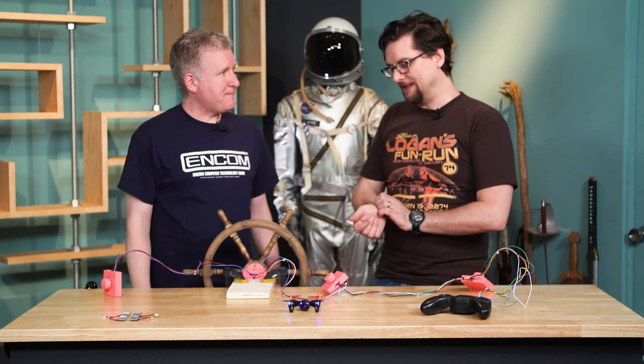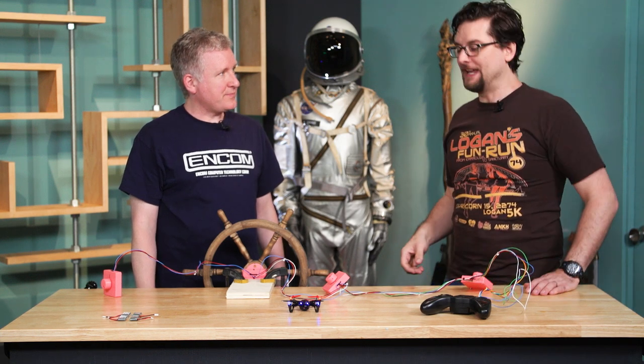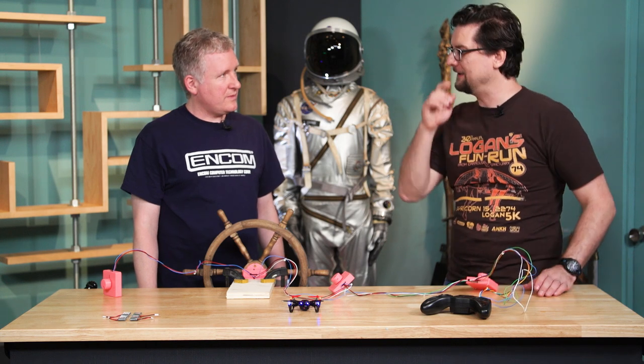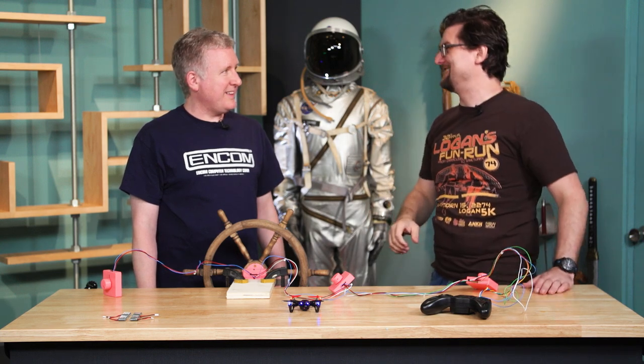We'll figure it out. And when I did these, originally we talked about doing a lever type thing for the throttle. Right. And the interesting thing, I actually had that design. There's an extra hole in these where I put a rod in. But the travel on the pots is so great that I had to go with knobs. It's more than 180 degrees. Like you'd have to be off the side of the table. Yeah, that's something you don't often think about when you spec parts: how big the throw is, how many degrees of movement. So it's all things you have to consider.